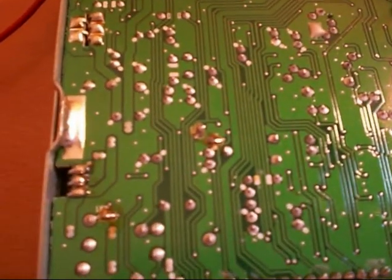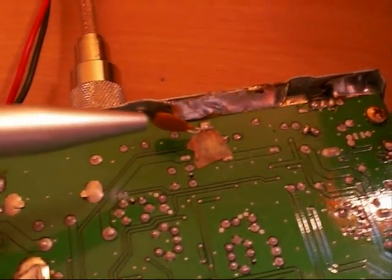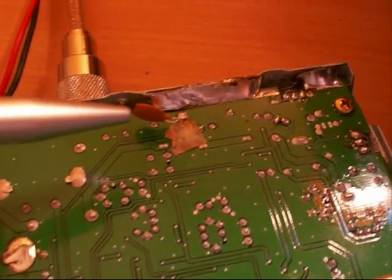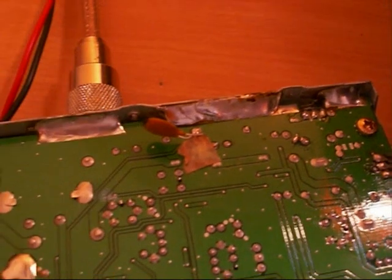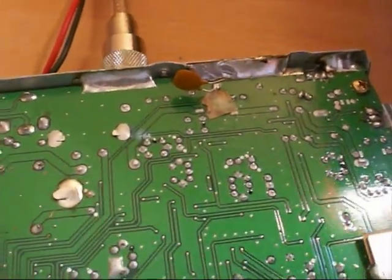On the standard 4 watt version, these jumpers will not be bridged — they won't be short circuited — so you need to do that. Down the back here there's a capacitor. I haven't seen this present on all of the ones I've done, but it is in some of them. If this cap is not removed the output will not go up very much — only about 2 watts — so you need to remove it.